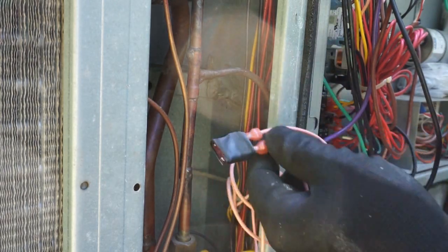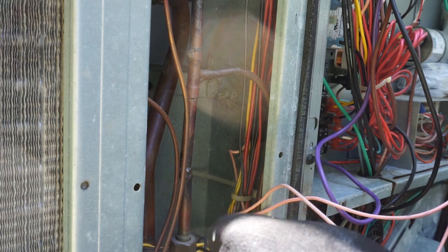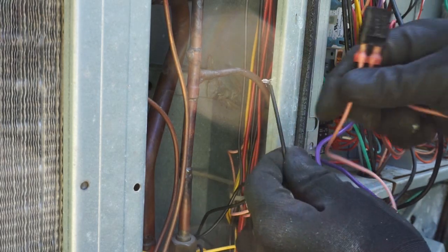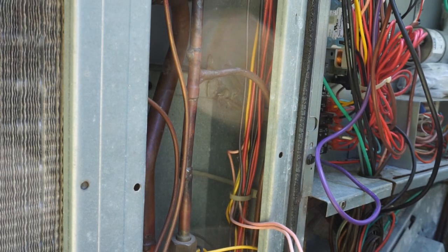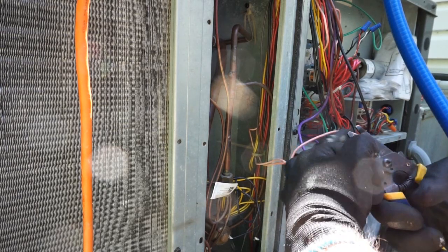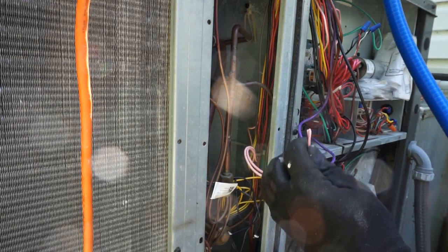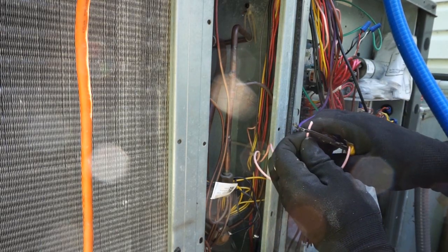So we had a fuse here, a three, but it's already a fuse on the board. So we're gonna take the leads that come from our pressure switch, which are right here, and we're gonna tie them, each one of these leads, wire nut them off. Extra crap.